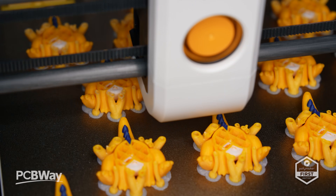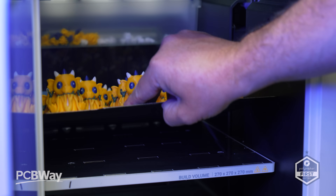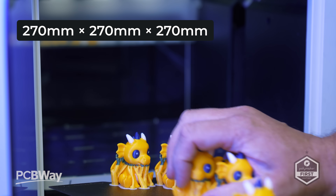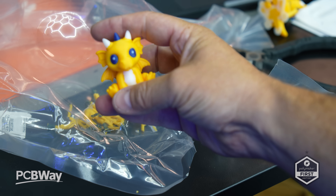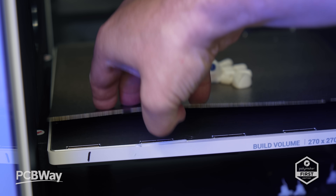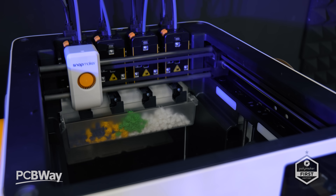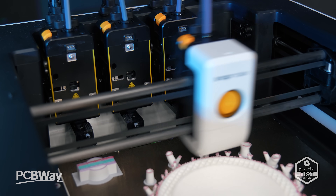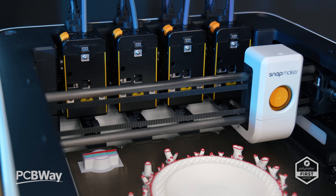The U1 is fairly unique — it's a Core XY tool changer, likened to the Prusa XL, only smaller and with one fewer printhead. It's a 270×270×270mm bed, which is slightly larger than what we've been accustomed to with the ever-popular Bambu lineup. The real change of pace here is around speed — not regarding flow rate or kinematic speeds, but by saving on purging filament times and fast tool changes, which dramatically reduces overall print time and saves a great deal on wasted purge materials. The tool heads do still extrude a small amount of filament into a below collection tray, and this is increased when using the extrusion calibration option. There is also a purge tower available, meaning waste is not entirely off the table — however, it is significantly reduced.